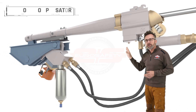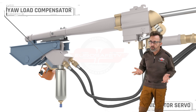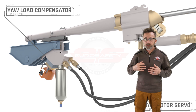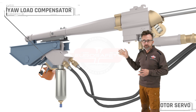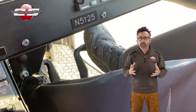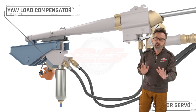The purpose of the Yaw Load Compensator is to help us move the pedals after a hydraulic failure. During normal operation, the Yaw Load Compensator really has no job. But if we have a loss of pressure in the system — on that side if it's a dual hydraulic system helicopter — fluid stops flowing to the servo, and then the Yaw Load Compensator will help us move the pedals. It doesn't give you fully hydraulic feel pedals, but it does help you move the pedals, particularly in a high-weight scenario.